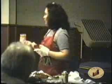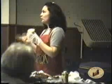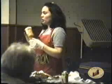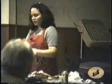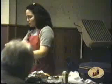What can happen with flakes though is blocking. I don't know if anyone has experienced that. With heat and humidity, this will turn into a brick, and then it is very hard to dissolve, and you almost have to throw it out. So you just want to be careful of that. Blocking is a problem. This one just has to be shaken really well. This in particular is the garnet, so this is a dark color. And this is a padding lacquer.